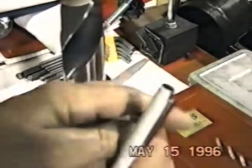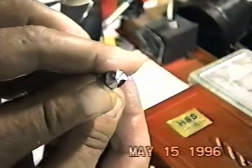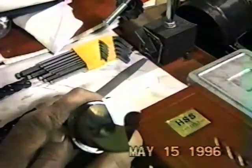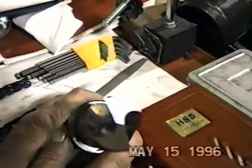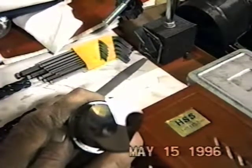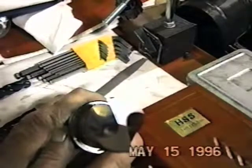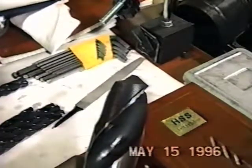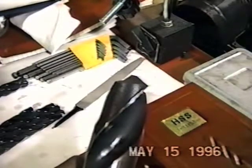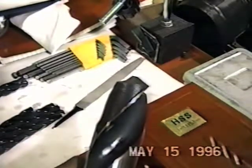For demonstration purposes, you can see reasonably close that I have about 108 degrees. To change the chisel angle on a drill, all I need do is either advance or retard the locator dial setting. If I advance it, I increase the chisel angle; if I turn it the other way, I will reduce the angle. To change the clearance angle on the drill, all you have to do is, if you want more clearance, increase the setting on the feed dial on the side of the machine or change cams.